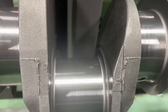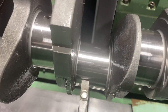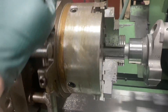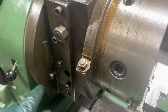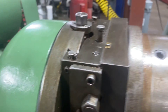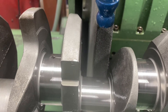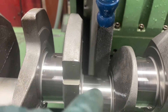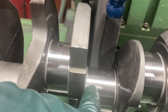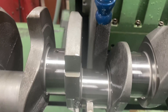There's a lot of setup to this thing. Got your stroked wheel here, a little dial. It's hard to see, but side to side there's all kinds of stuff. I've got a smaller wheel than the length of the journal. The theory here is when you plunge grind, you come in about half to go, then run the wheel over to the left side of the journal, run that into size, and then sweep across to see if it's parallel. Pretty good stuff. Got one more to go.